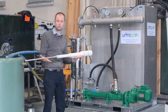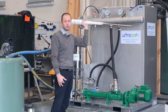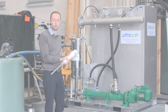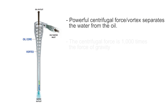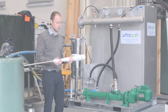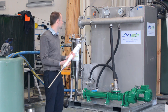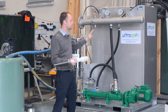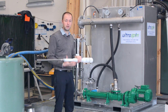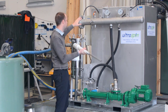This is one of the Ultraspin separators, and it sits within that vessel. It doesn't move — it's just the force of the water moving within the separator that creates the separation that we need. The Ultraspin separator operates at more than a thousand times the force of gravity, so the water is ripping around inside and pulling the oil out. What we end up with is treated water coming out of this end and our separated oil stream coming out through this end of the separator.